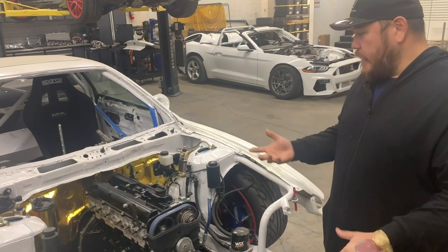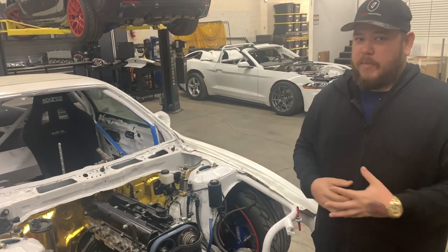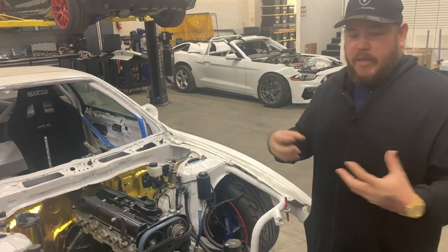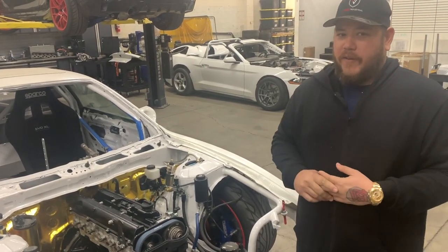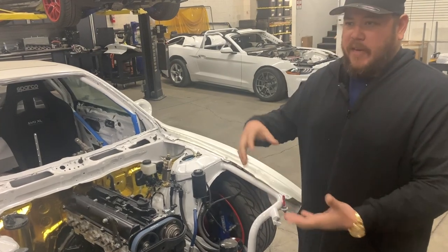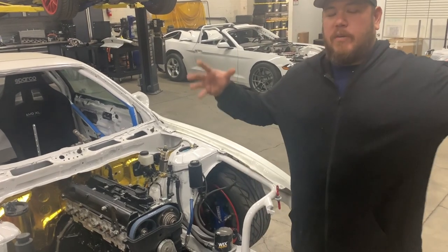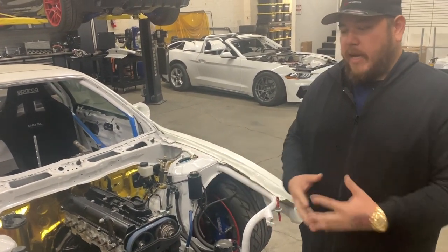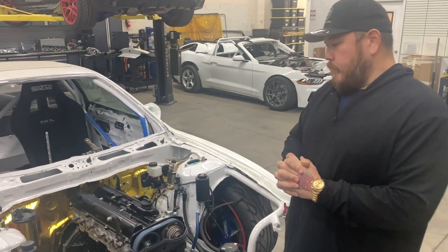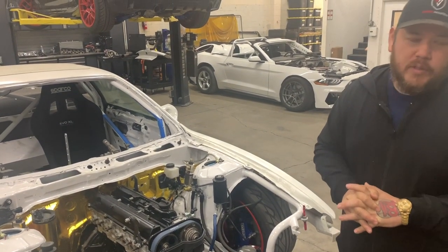We were doing a Ford V6 block where our mains were at 1.3 thousandths but needed to be at 2.5 thousandths. Just bringing it from the shop into the build room and letting it stabilize to 70 degrees, it opened up over a thousandth in the main journal. That's why you need cars to reach full operating temperature before running them hard. You don't want to cool your car down to 150 degrees and then go rail on it at the track.